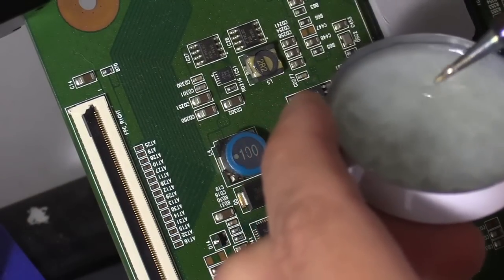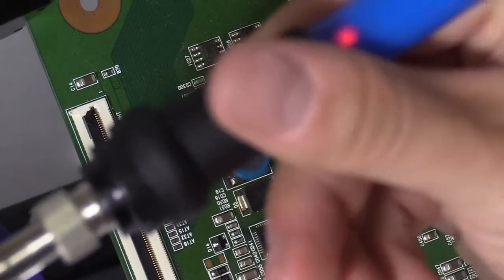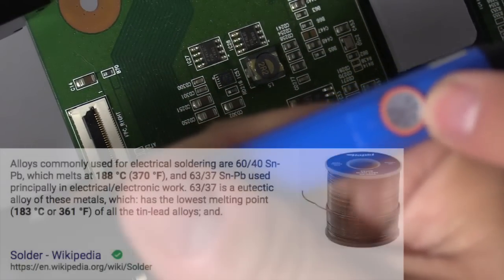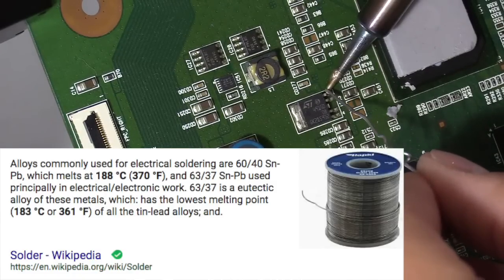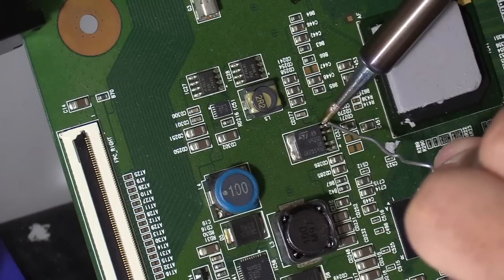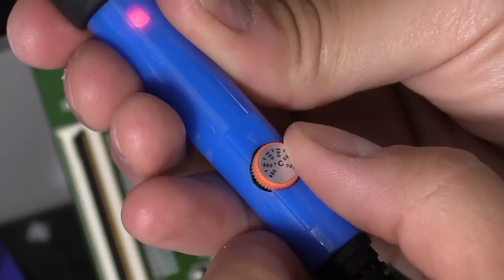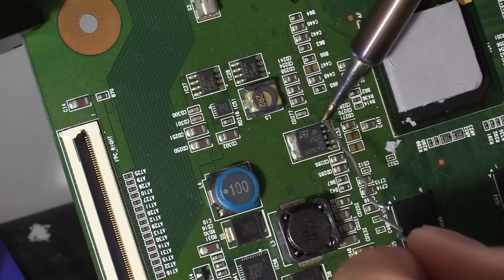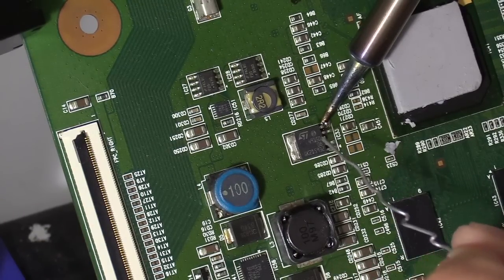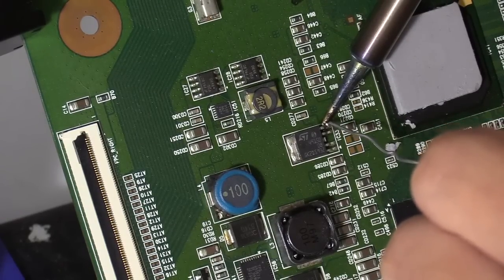I want to go ahead and clean the tip and then tin it so it's ready to use. So I'm going to use a little bit of flux right here on the tip and then heat up the tip. By the way I have the setting set to the middle setting. You don't want to overheat the solder pad because it will fall apart. So I'm going to heat it up right here and apply the solder. I probably have to increase the temperature a little bit. So to increase the temperature you just turn the dial up a little hotter. I'm going to set it to 350. And that should be good. You can see how much longer this one takes. The electric plug-in one takes a lot longer.